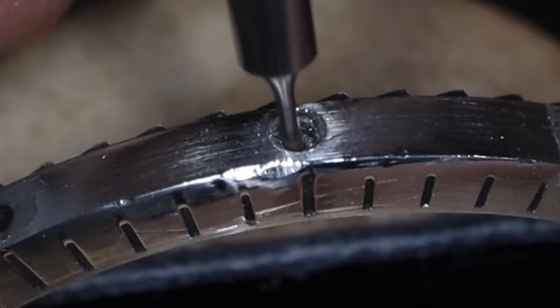I've put some D5 on the crown wheel core where the chronograph cam will sit, and some D5 on the ratchet wheel driving wheel. I'm using 9501 on the chronograph cam, and all the oiling points are indicated on the technical sheet.